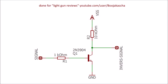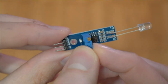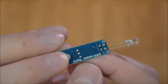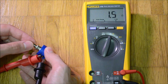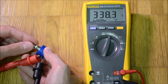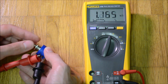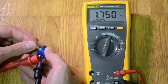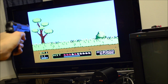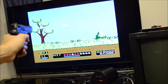For the inversion I use a 2N3904 transistor. On the board itself is an SMD wire-wound potentiometer. Wire-wound potentiometers theoretically offer more travel and can be set up more precisely; however, this particular piece has no tactile start and stop position and will simply continue to roll over without further changing resistance. This makes the dial-in process unnecessarily cumbersome, and I would understand if someone preferred to swap the potentiometer for another model.